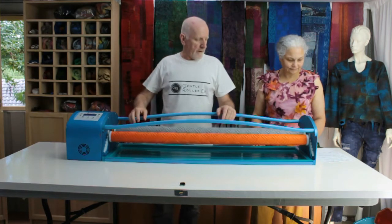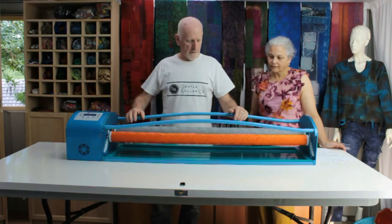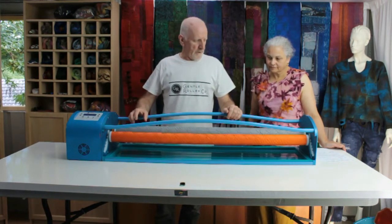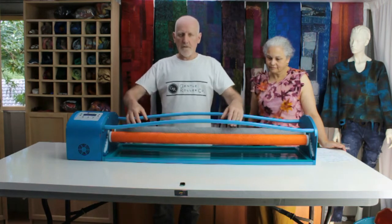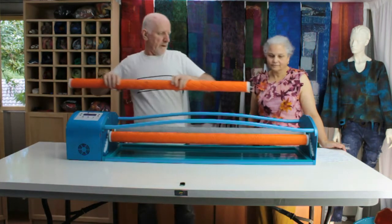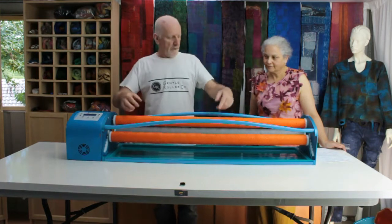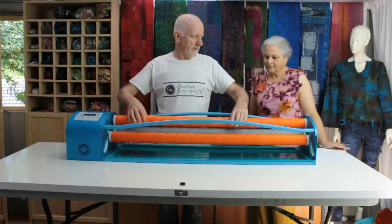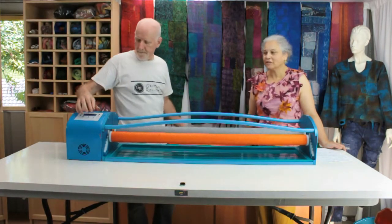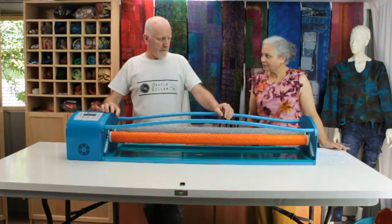And you can see that as the drive roller is driven forward and backwards in its oscillating motion, the idle roller responds to it, and it's just the force of gravity bringing them together. You can in fact use three idle rollers with a third one on the top, creating three points of contact. It is indeed a very clever way of addressing my key criteria of replicating hand rolling. It does. It replicates hand rolling perfectly.